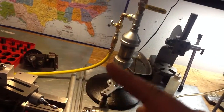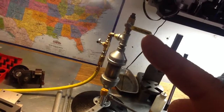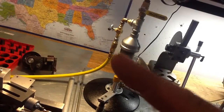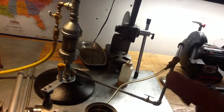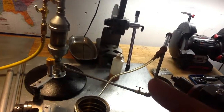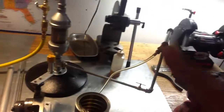I've got air pressure coming in off my air compressor in here, and then the vessel is just filled with common motor oil. I got a valve there that I can use to refill it. The air pressurizes the oil and then the oil comes out over this thing. If you remove the hose, I can just kind of position this to just spray oil on whatever I'm cutting on the lathe. But in this case I'm just using it to test this thing, because like I said, I don't have a pump. So we've got air coming in over here at a hundred pounds per square inch, pressurizing the oil that's in there, and then that's coming off to our valve and hydraulic cylinder.